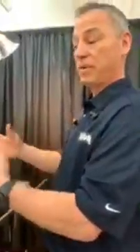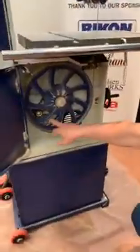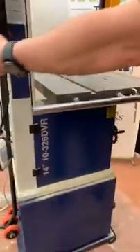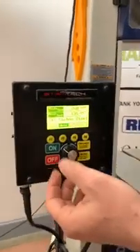Function two is the section for cutting all your metal. There's a lot of metal work being done in woodworking today, and instead of purchasing a secondary bandsaw, now you can have one tool with the proper blade to cut all those functions. Our bandsaws come standard with two-speed pulleys — when cutting stainless steel or titanium, you lower the pulley position on the bottom wheel to the lower setting for lower RPMs and additional torque. It will prompt you to change the pulley position, and you also have cast iron and carbon steel functions.